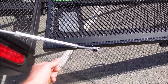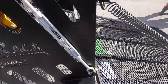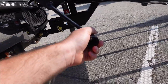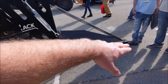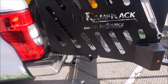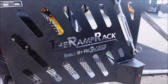When you do that, you'll drop this pin in and tighten this linkage. You'll want to push the linkage against the ramp so that it really pushes that down just a little bit. Then you drop your jack leg — there's a pin right there, you pull that pin out, drop the foot in the jack leg, lock it back in, and then turn this crank. That lowers your jack stand down and starts to lift the dovetail. You jack that up a little bit to take some tension off these pins, then pull the pins out, go back to the jack, and continue jacking. That lifts your dovetail off this little washer, and once you've cleared that washer, you're able to pull the truck away from the dovetail. Reassembly is basically the reverse.